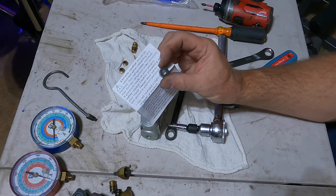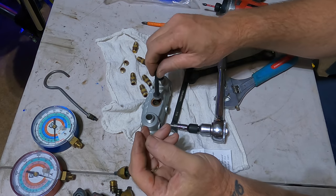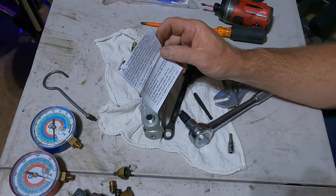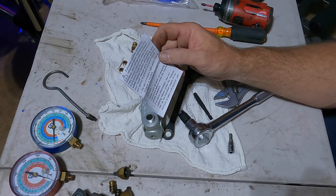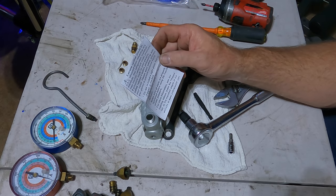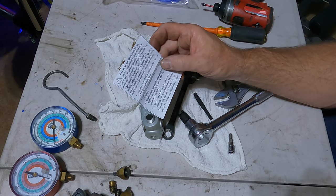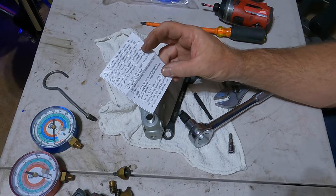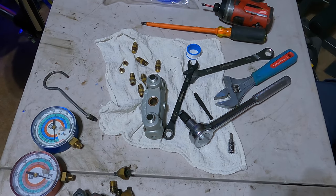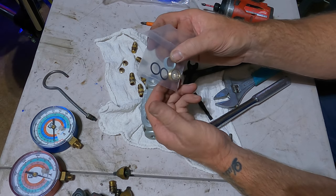In the repair kit you will get the sight glass tool, and it does have the opening for the quarter-inch drive, and it will fit into your sight glass. The instructions that come with your rebuild kit for your Yellow Jacket Titans say: use extreme caution when rebuilding any manifold — your refrigerant manifold may contain refrigerant under pressure. If pressure reads on the gauges, safely release it before proceeding. Always wear safety glasses and gloves. Do not reinstall a sight glass that is chipped or cracked. Do not reuse parts with damaged threads. Make sure all parts are properly tightened before using the manifold under pressure. The sight glass has two gaskets, the sight glass, and the retainer.